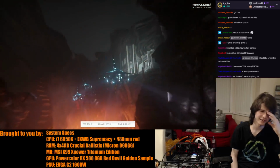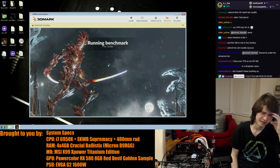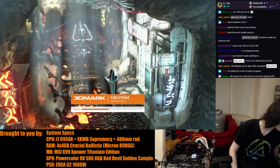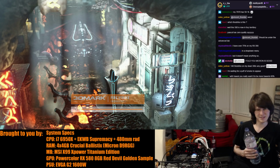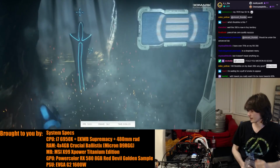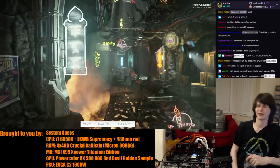I remember the GTX 1070 I had was doing I think 2400 or maybe 2500 megahertz memory clock on GDDR5, because it's a 1070. And it was Micron as well. So this might not be such a loss after all. But the core, man, the core, it sucks. And the heatsink is not good enough. It's not terrible. I'm sure you could buy 580s with way worse heatsinks, but I'm not impressed. And I legitimately think that inside a case, the airflow pattern for this heatsink is gonna conflict with most cases in terms of airflow.